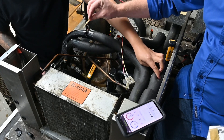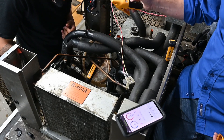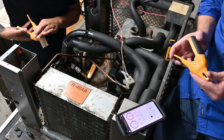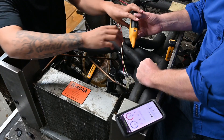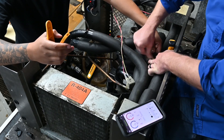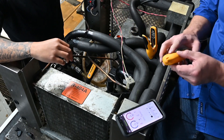What we need to do also is when you put the clamp on, just sand it down a little bit on the top and the bottom where the clamp is. This one's going to be the suction. The TXV is here, so we're going to move it down over here a little bit.